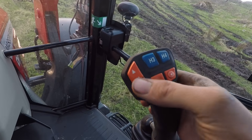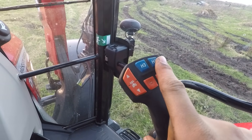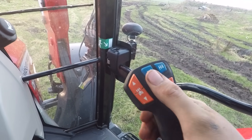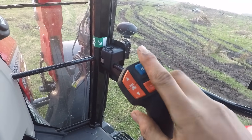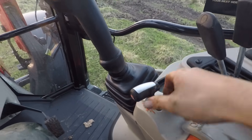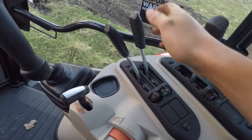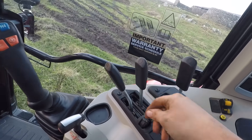Push in hit forward and push in hit back. Then you've got your H3 and H4 - these are your two programmable buttons. You can either have four wheel drive, diff lock, or engine rev on these buttons. Just now we've got the four wheel drive on H4 and just the standard third service on H3 for the loader. You've got your standard T-lever down here forward and backwards, then the button on the side for the range. You've got your hand throttle there. You've got your three spool valves, all double acting.